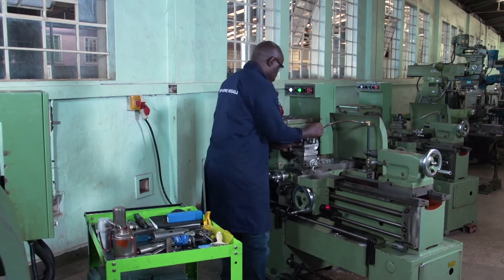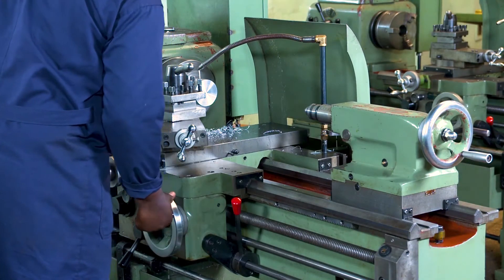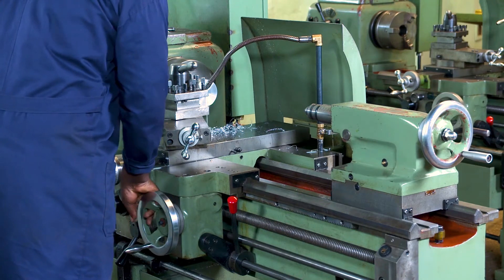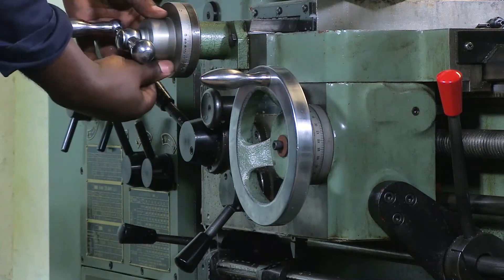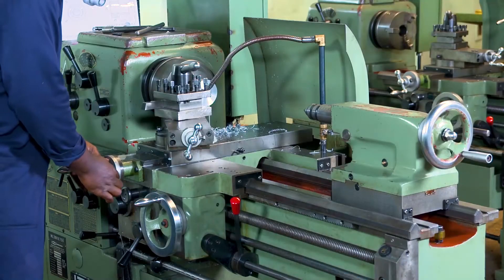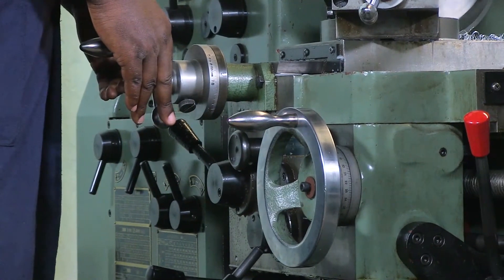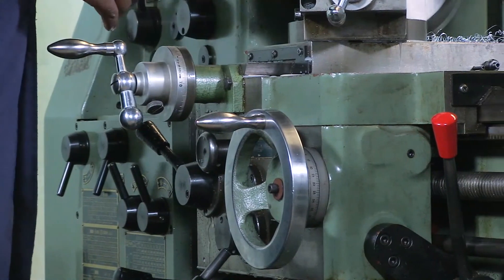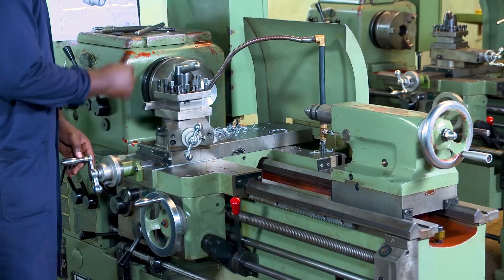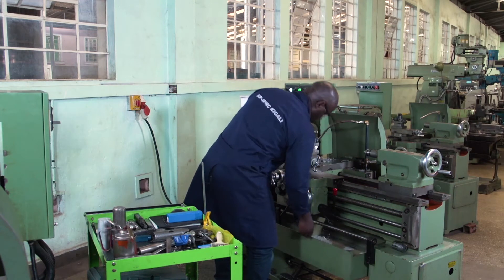The next operation will be plain turning. Now we switch on the machine. We touch the outside diameter, then move the carriage in the left direction. Now we set our micrometer here to 0. Because for the first time I'm going to remove 1 millimeter — if I move from 0 to 1, 1 millimeter will be removed from our diameter. It's not meant that the cutting tool makes a displacement of 1 millimeter; the cutting tool moves a distance of 0.5, and 0.5 millimeter will be removed from this side and the other side, so on the diameter we remove 1 millimeter.